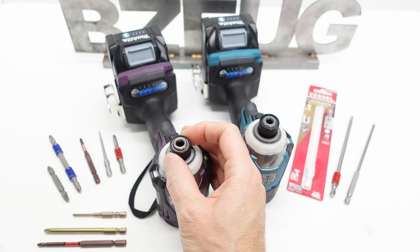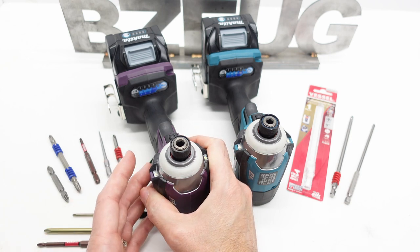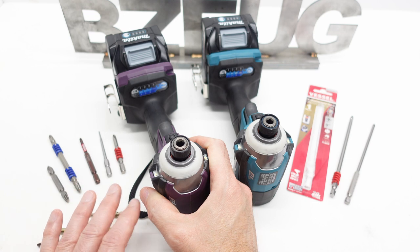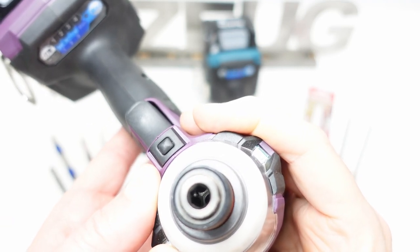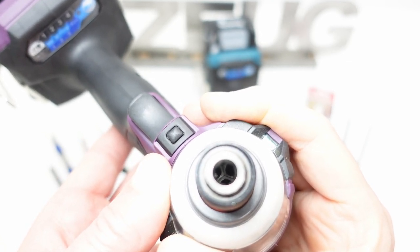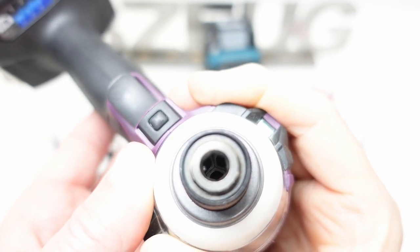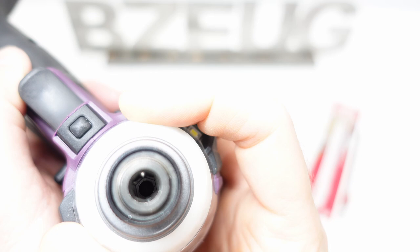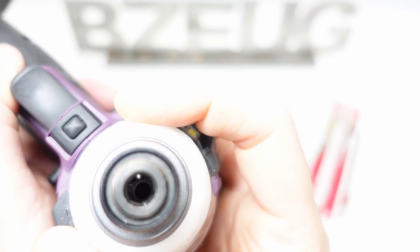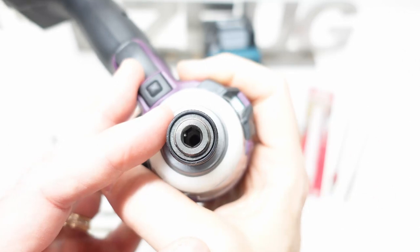I never had that experience because I never intended and never have put E6 bits in my JDM Makita. I bought this JDM Makita as a way to use all of the different types of Japanese bits I was curious about. If we look inside this chuck, we see two locking BBs on opposite corners, and then it's a straight hex down to a flat surface that has a hole in it. That flat surface is what the Japanese bits rest on. What appears on camera to be a dark circle at the bottom is actually a rounded-out bowl. A double-ended bit has three millimeters of tip that go down inside that and bottom out.